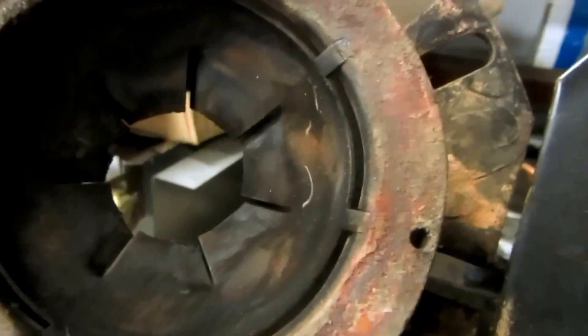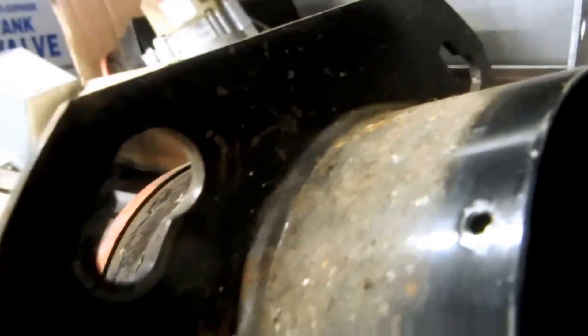There's another one here. This flange is welded, so that's kind of limited to what you can do on a replacement — you wouldn't want to use something like that because you have to get it in a certain distance; you're kind of screwed there. This one came off a furnace too — see how it's all welded. So I wouldn't use these end cones; you can buy a different end cone. This one here I could reuse — it's an adjustable one.